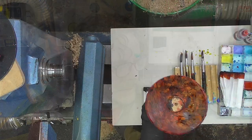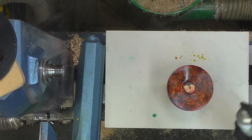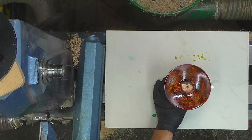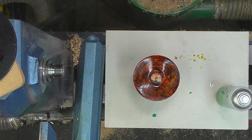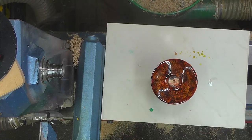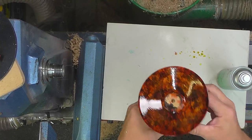I told you it might look a bit muddy. You need to resist the temptation to put too much lacquer on, especially the first coat — so there's the first coat done. Let's leave that 20 minutes. Second coat going on now, building up the thickness and the shine even though this is satin. Let's leave that to dry off and do a third coat in about 20 minutes.